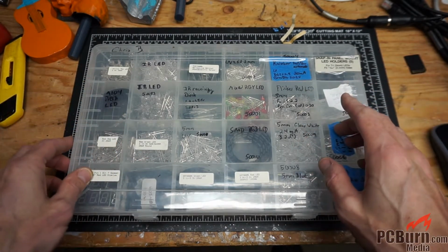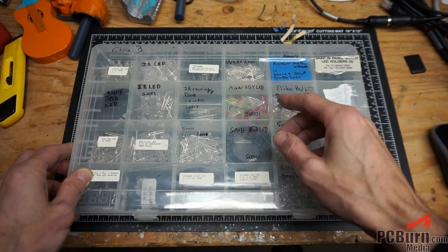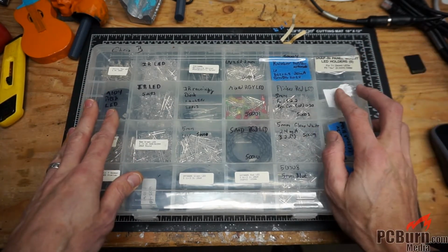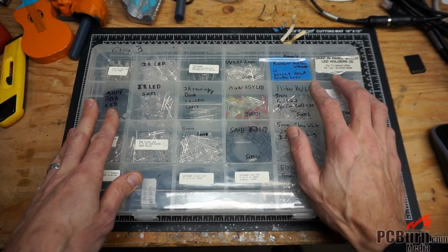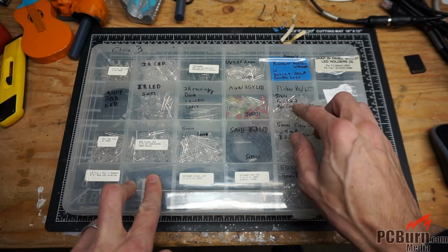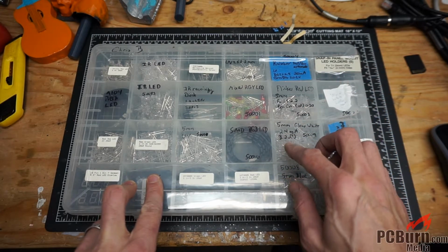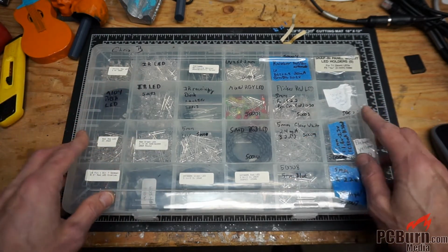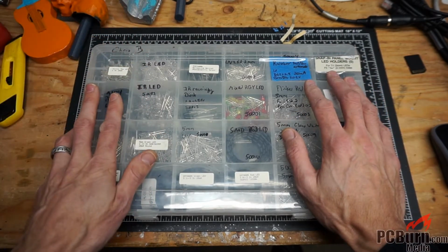Alright, so what I'm looking at today is a simple light made from an LED, a switch, a power source of some kind, and a resistor in line to limit the current flow and provide a voltage drop for whatever forward voltage is on the LED, because you'll notice these are 2.1. These are a forward voltage of 1.8, 2.2, because they flicker, so it's variable. There's a 3.2 volt for the clear white. They're one of the higher ones, and I think the blues might even be a little higher than that. So there's various forward voltages on these, and you need various resistors to account for that.